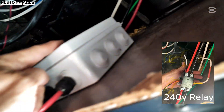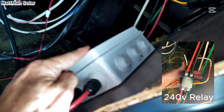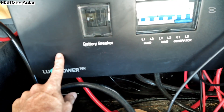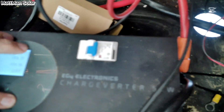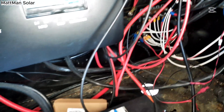That comes in through a relay switch here, if I'm running it off of the charge controller so that it runs at a reduced rate or off of 110 voltage. That relay is connected to the 6000 XP, and it uses the dry contacts to flip it on and flip it off. There's a relay in here that turns that power on coming in through the main charge controller. So you can just leave that on all the time, and it basically just kicks on whenever it gets the right voltage. I don't have the grid plugged in very often, because I simply don't need it.